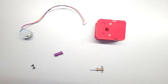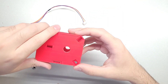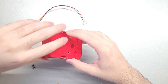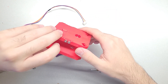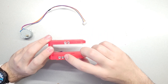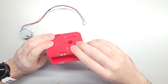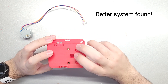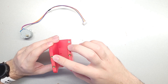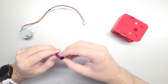Now we're going to talk about the X gantry. Here are all the parts required for assembling the tool end. This 3D printed piece is very complicated with lots of detail - there will be a dedicated video on the evolution of this and the whole tool changer system. For the assembly: after printing this part, you'd have to get M2.5 square nuts and glue them into the square holes for belt tension. You can also get two M3 2mm threaded inserts here, and M3 4mm thread inserts for the bottom cap.